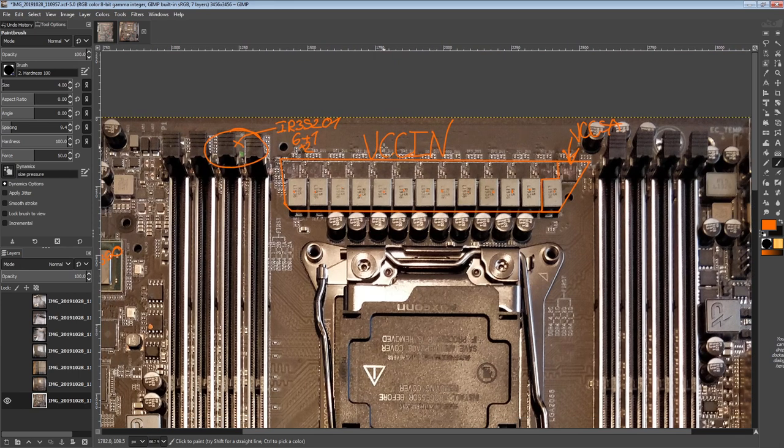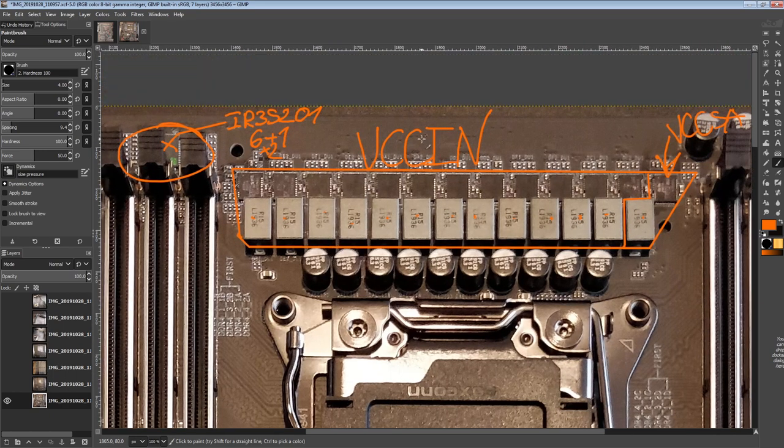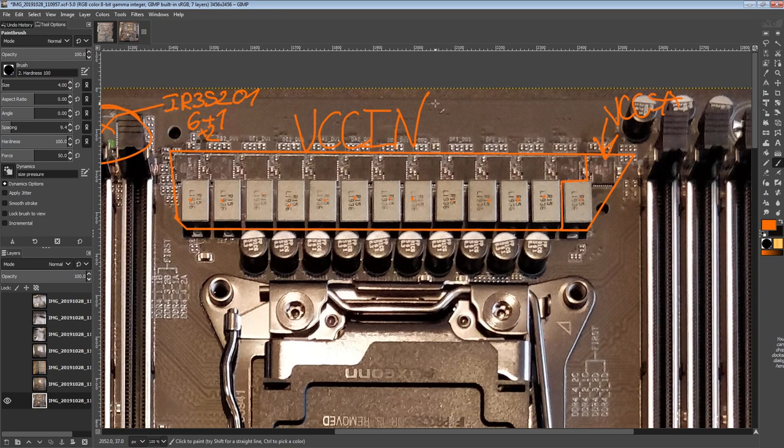This is a far more efficient power delivery method than ramming V-core into the CPU from an external VRM, because you significantly reduce the amount of current the motherboard's VRM has to produce. There's less power loss in the socket and the power plane. The integrated voltage regulator also does better voltage regulation than external regulators. So the control scheme of this VRM gives us basically an old-fashioned 12-phase — and this is a 12-phase VRM.